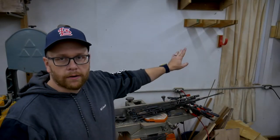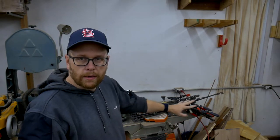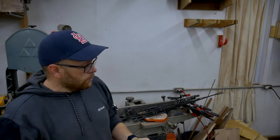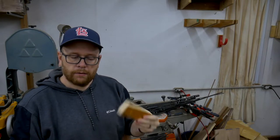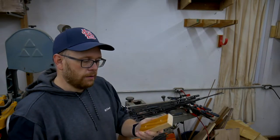I already mounted a test hook over here on the side — you'll have to excuse the mess; I had to evict my clamps to make room for the dust collection and I'll have to relocate them. To hang the pipe hangers I made these blocks out of scrap wood. The wood is actually a full inch thick, not three-quarters of an inch, and there's a reason for that which I'll explain in a minute.